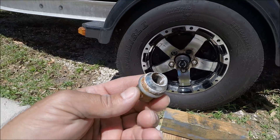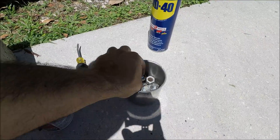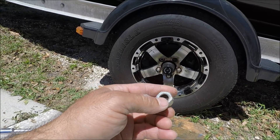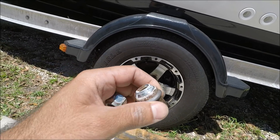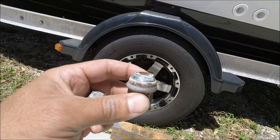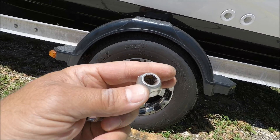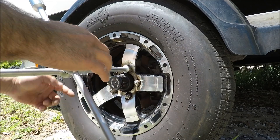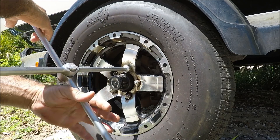What I'm doing now is taking these bad-design bolts, throwing them away, and using the old bolts — which if water comes in, it will go out the other side. They're easier to clean and to rinse. Meanwhile this salt water will go inside the decorative bolt and it's gonna corrode it until it shuts the bolt. So definitely change to the type you can rinse off and not have a problem. It doesn't look as nice as the decorative one, but it's not all about looks — this is gonna create a problem in the future.